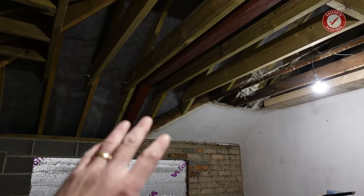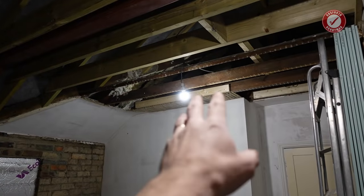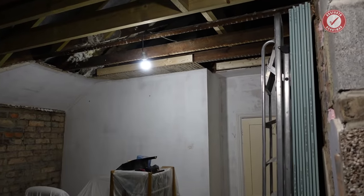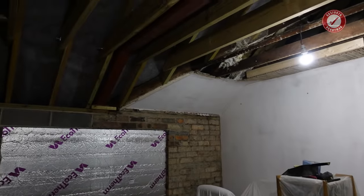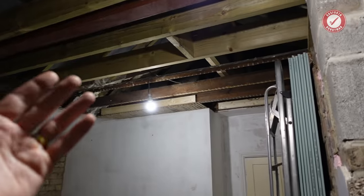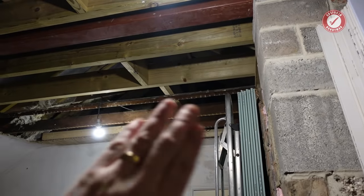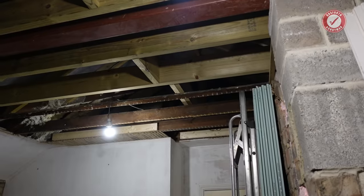The guys at iWeld did an awesome job with it. We got this made ages ago right near the start of the project because we had to get one put over the bathroom - there's an identical beam sitting just behind that bit of wood over there. We wouldn't have been able to do the bathroom plastering and ceiling until that steel was in, so we had it done early. Because we needed two identical bits of steel it made sense to have both made at the same time. What that steel does is provide extra support for the hip, because we've kind of mangled the hip roof to extend it. The structural engineer said that because we don't really know about the structural integrity of the existing timbers - some might be a little thin - he wanted something to support the new hip and make up for the timbers we've taken out that were supporting the old hip.